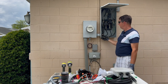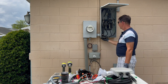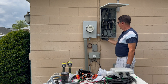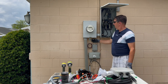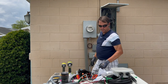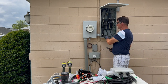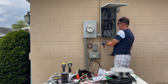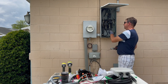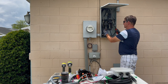We need to get into this panel very carefully. These are your line side coming off the meter — be very careful not to hit any of these. I'm going to knock out one of these three-quarter inch knockouts, probably the outside one, and run the flex under here over to where we're going to install the charger. You've got to be careful and mindful of the live wires — you don't want to hit them with anything sharp. You don't want to take a screwdriver across there; it's going to blow up in your face.